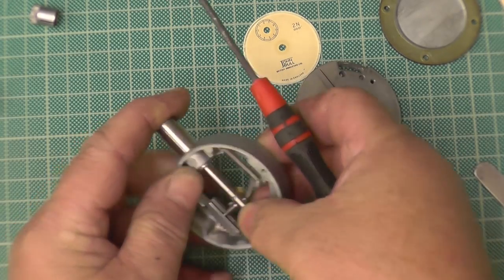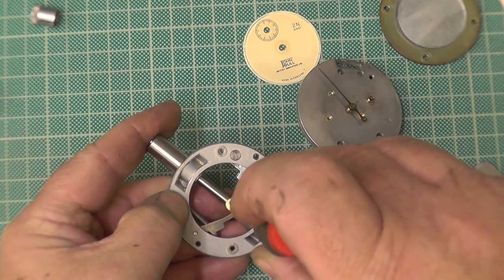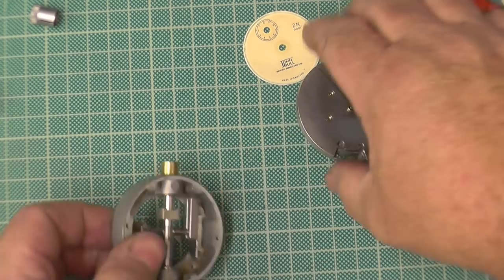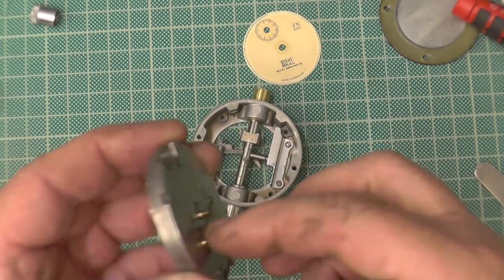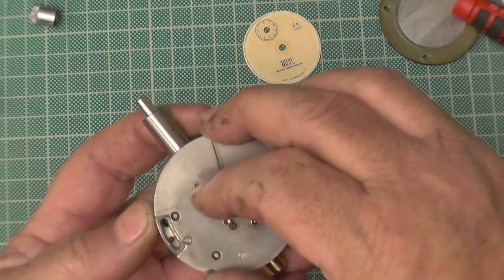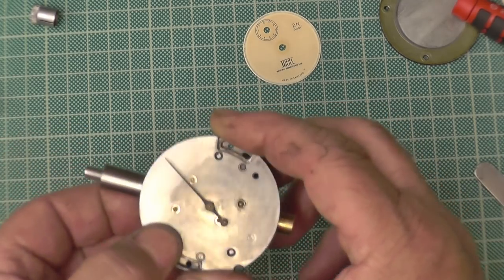So you've held out the right distance? Yeah. Keeping it, the plunger can't go any further down because my finger's stopping it. There we go. I'll have to wind this up again because I let go. It's a big spring, so I'll take about 3 turns. Engage it on the rack. Basically, you want to jam the movement up to keep the tension in the spring.